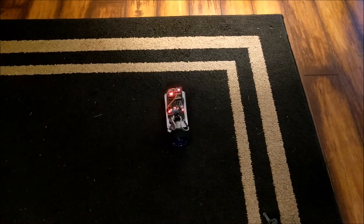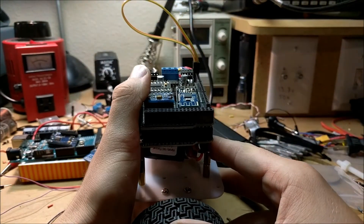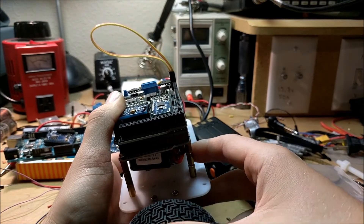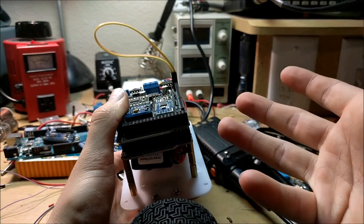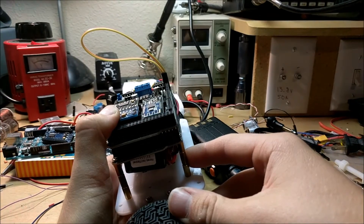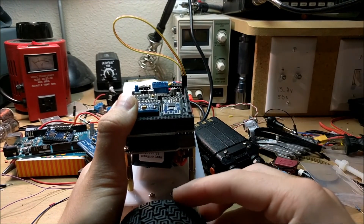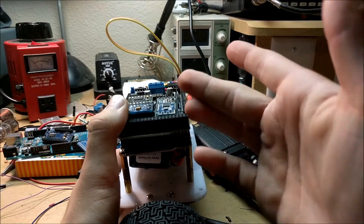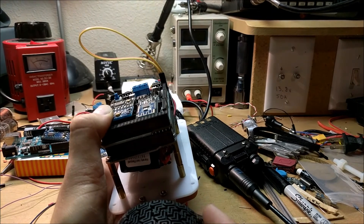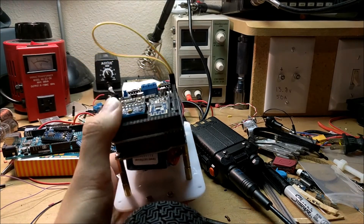You can also do some pretty good donuts. This robot works using the accelerometer sensor — when it's straight up, the sensor sends a value meaning it's upright. When it tilts, it sends a value that it's about to tip over, so it changes the wheel power to right itself. When driving forward, it adjusts the sensor's reference point so the robot thinks a slight forward tilt is 'straight,' constantly giving the wheels power to maintain that position, which drives it forward. Depending on the tilt angle, it drives faster or slower.